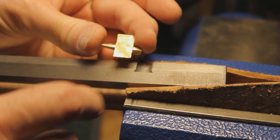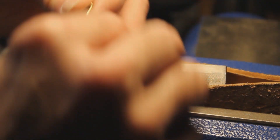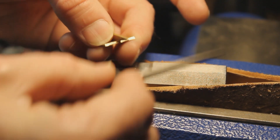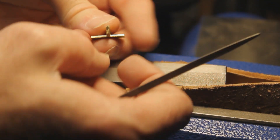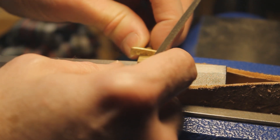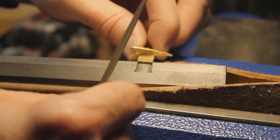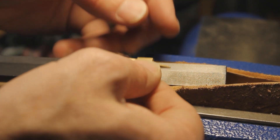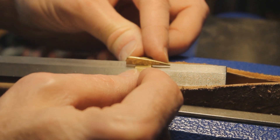That's all there is to the rear sight. Getting ready to put the front sight in - I did pretty much the same thing. There really wasn't much cleanup on the bottom; you can still see it's pretty much as cast. I came in with a small triangular file with one safe edge, put the safe edge up against the bottom of the sight, and in just a few strokes on each side cleaned up the bevel a little bit, trying to maintain the angle of the dovetail. Initially I couldn't get it to go in - the dovetail was pretty tight - but much like the back sight, just a very small amount of creating a lead got it to go in from one side about halfway.